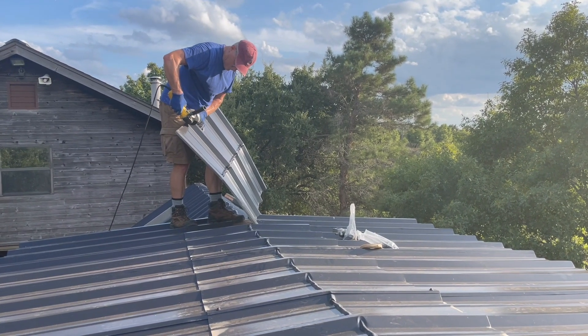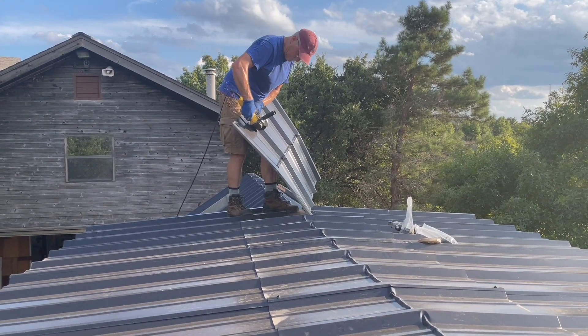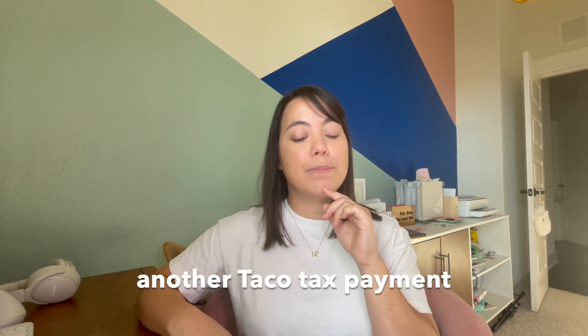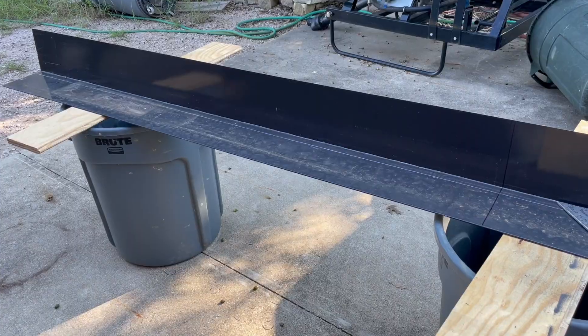At the very end of the top of the roof, we had to cut those pieces to size and Doug just cut them right from the roof — not the safest way to cut metal, but he did it and was fine. For the metal needed under the skylights, we were able to reuse some leftover metal from the siding above the first lower roof — that black bent piece worked perfectly under the skylight. Then I started caulking the metal and sealing up any gaps, using black caulking to match the metal.